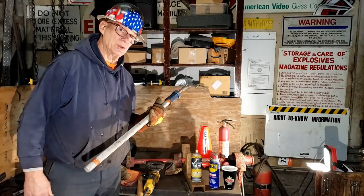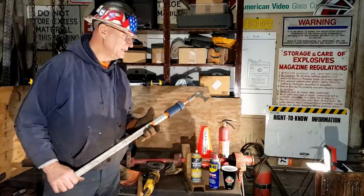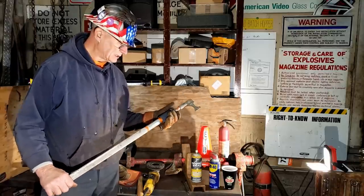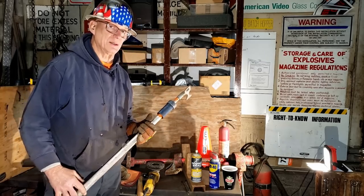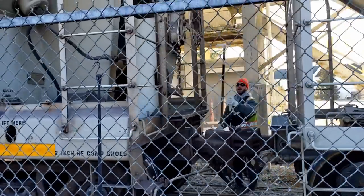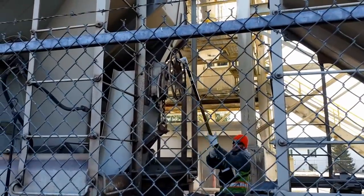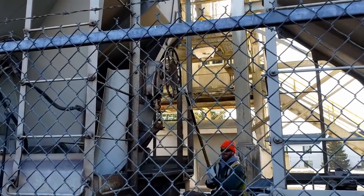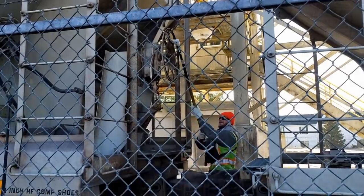This is a railroad tool that's used by the brakeman, and he does this as a safety item. This item right here is what is now used, recommended, and maybe in some places required to tighten the handbrake. You hook that in the hand wheel and go round and round and round, and you can snug that wheel down with this. This shape right here is because you can open the coupler up with it.